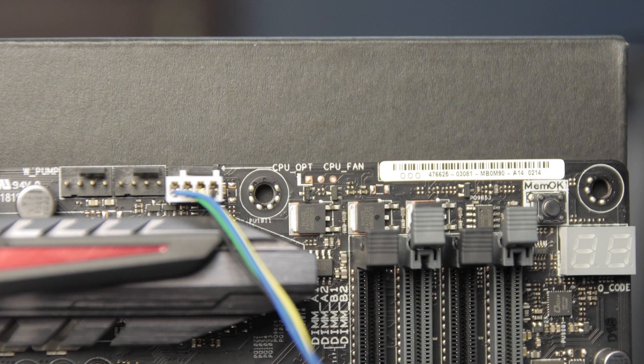At the top edge of the motherboard we've got three fan headers — really two fan headers: one for the CPU fan, one for an optional second CPU fan in a push-pull configuration, and then another header for your water pump. There are features in the UEFI that allow you to control how the water pump works in terms of how it responds to temperature, and whether you need PWM or DC control. All fan headers support both DC and PWM control, and the pump header has some extra operational modes.